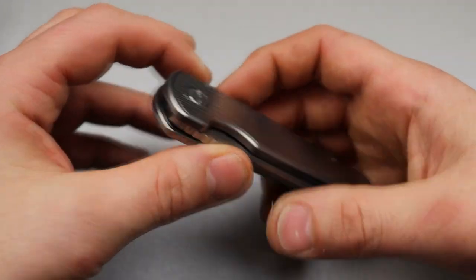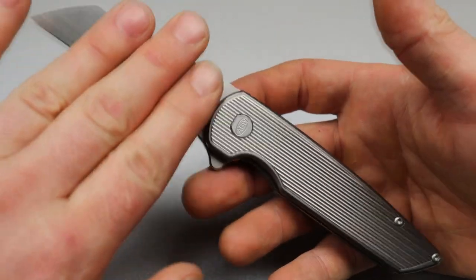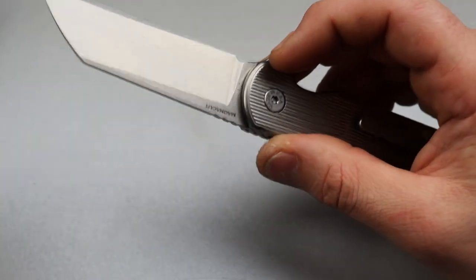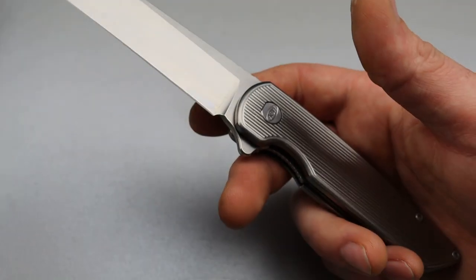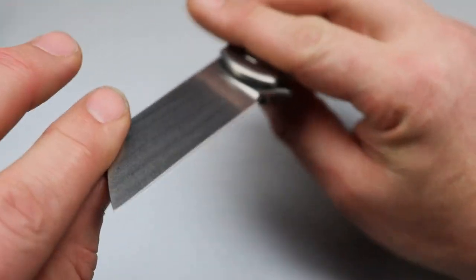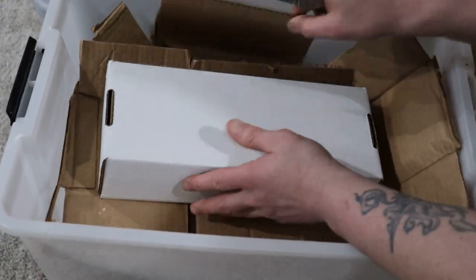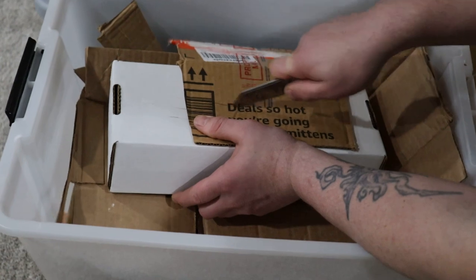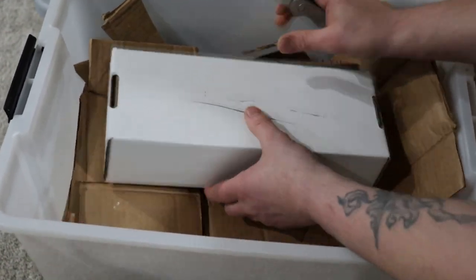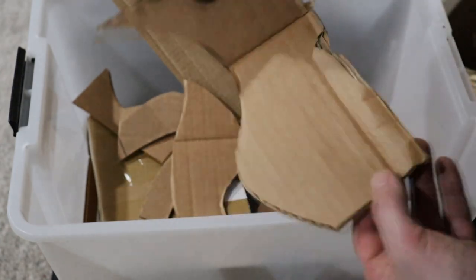All in all, it's an amazing USA-made knife. Not only the machining and the insane geometry, but the well heat-treated steel — being 63 to 64 HRC, that's probably a good heat treat. If you look, the blade has a very tiny, tiny bit of curve — it's such a small amount you might not be able to pick it up, but I can. It's so slight that you would never even notice it, not even on a stone. I can sharpen this just like a regular Wharncliffe. However, that tiny amount of curve actually increases cutting performance — it's like a claw when using it for utility cuts, and it actually slightly traps materials. I love the way this blade shape was done.